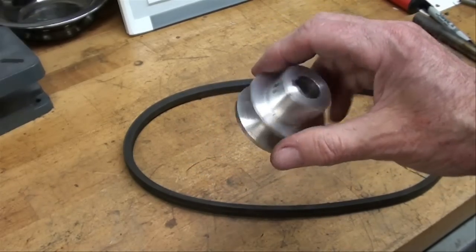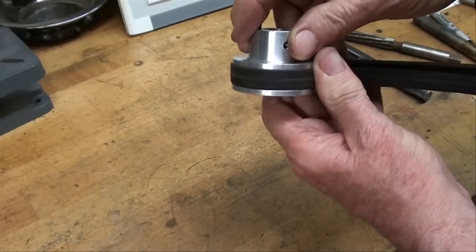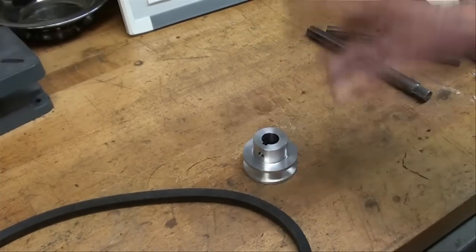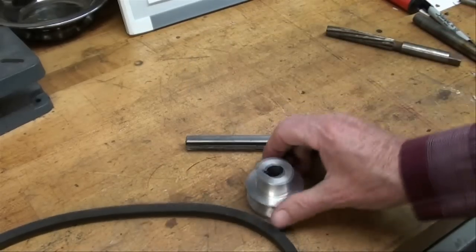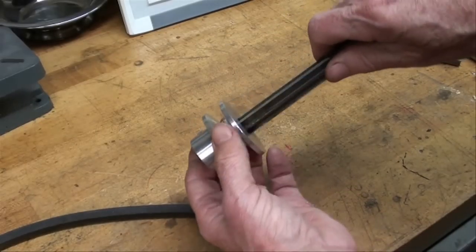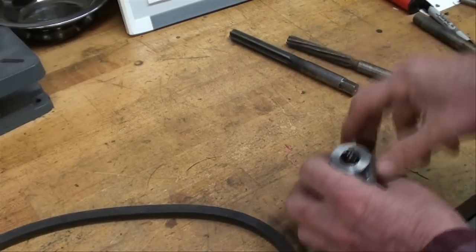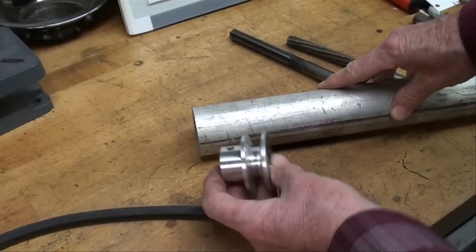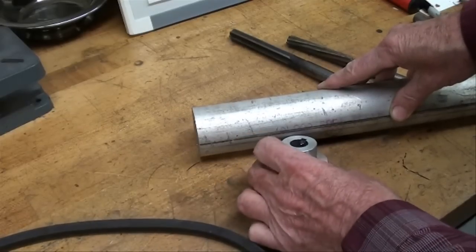There's the finished product. The hole comes right into the keyway just where I want it — I need to blow it out yet. The V-belt fits in there nicely. Surface finish is pretty good, overall appearance is good, dimensions are all within tolerance. Now if you need to ream a hole that has a keyway in it, don't use a straight flute reamer because it's going to chatter as it goes past the keyway — use a spiral fluted reamer. At the beginning of the video I said that somewhere in this slug of aluminum resided a V-pulley — well, I guess I have extracted it. This is Tubal Cain saying so long for now.